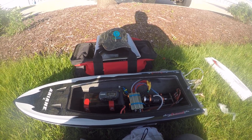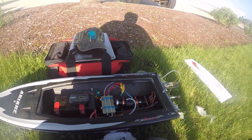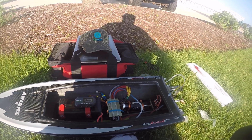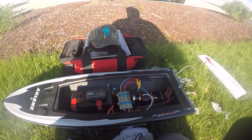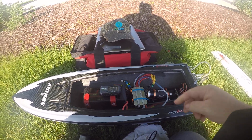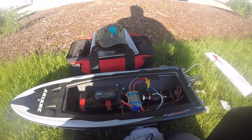These batteries are 6000s and they simply don't have enough for what the motor wants — it's pushing 255 amps and all of that is coming from one battery. Ideally, two 4000 6S in parallel for a total of 8000 would be a better configuration, maybe even two 5000s for 10,000 total. In a 2P parallel configuration, it'll split the load so instead of one battery supplying 255 amps, you get 127 amps out of each. It'll also be easier on the connector — one connector supplying 120–130 amps instead of 255.